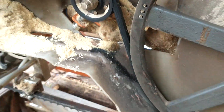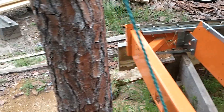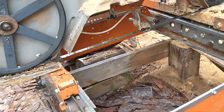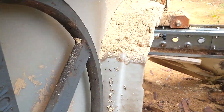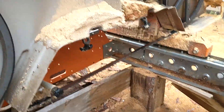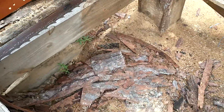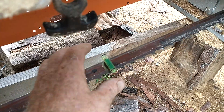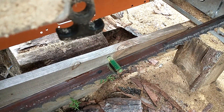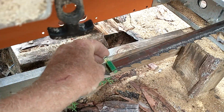You may not even know it and you'll be going along wondering why you're having issues. The main reason for dips and dives — after you've adjusted your blade guides — is blade tilt. I have a magnet on a level, and you put that level on the blade. If your mill is level and it looks tilted, that's a problem. You want it level side to side, but also level front to back between the teeth.